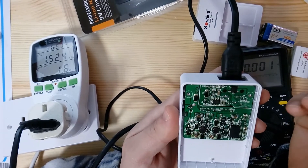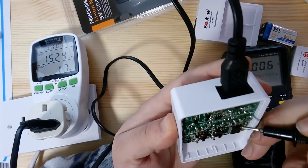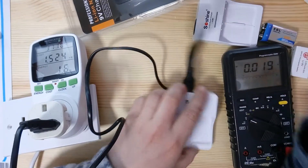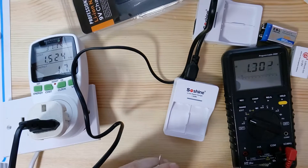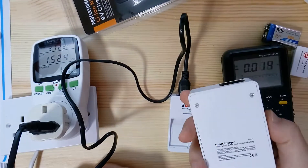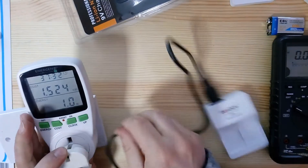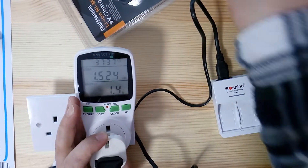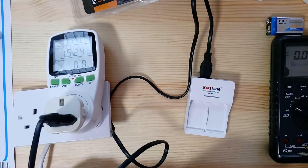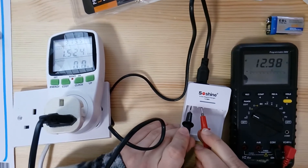I loaded both the primary supply and the output going to the battery — there's a 100-ohm SMD resistor on the bottom and a smoothing capacitor on top. It still kept operating at 12 volts. I contacted the supplier, told them it was faulty, and they sent a brand new replacement unit drawing 1.4 watts — but measuring the output again showed 14 volts.